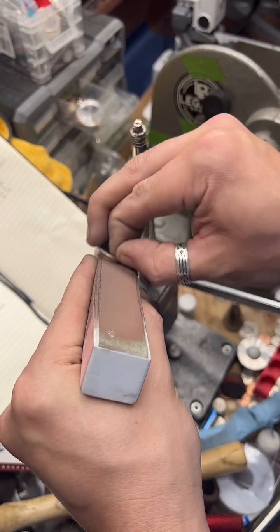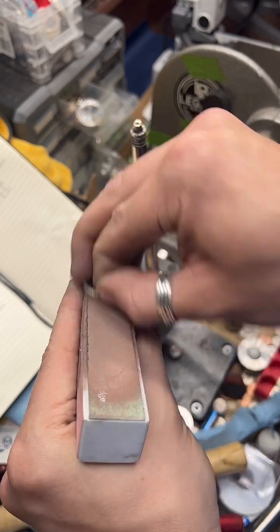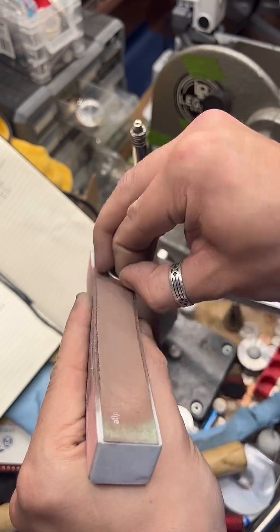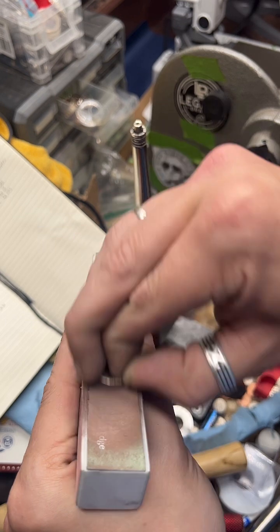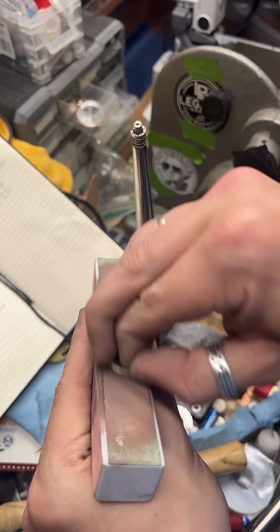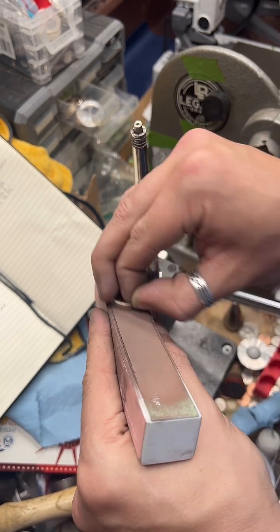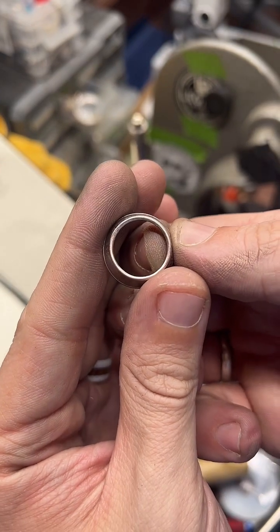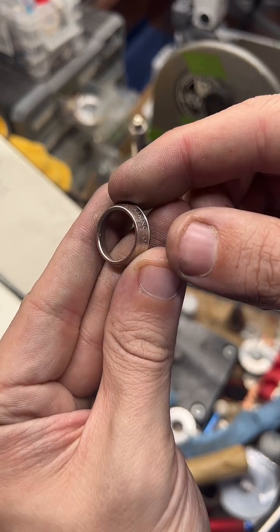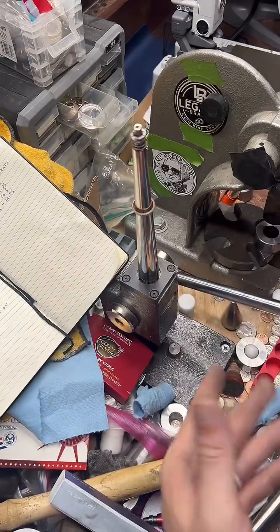And you can actually hear, if your ears are good, when it's smooth. You know when you're done, because it'll be less noisy. You just get all them scratches and cracks sanded down. This works a lot better than sandpaper too. Sandpaper usually gets really torn up when you try to do this. These blocks tend to survive much longer. And now we've got a really nice smooth edge. So those cracks usually start on this cut edge from a scratch or a micro fracture or whatever. And once you start stretching it, that crack will expand and split the ring.